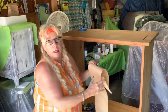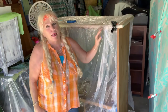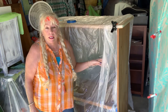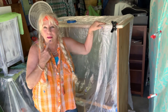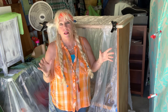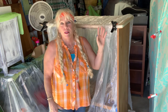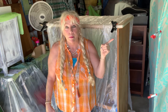I just need to paper all this off, because this is what I'm going to stain. I realized I don't want to get overspray on the inside, since I'm going to leave the inside wood. So I needed to hang plastic on it. Had I thought about that before, I wouldn't have had to tape the top off. Your prepping process takes a lot of time, but it really is going to help the end result of your paint job. So going through all this is going to be worth it in the end - don't forget your prep. That's my public service announcement.